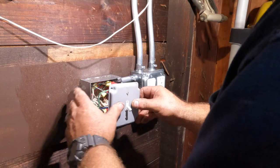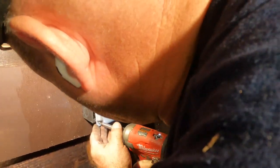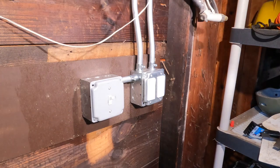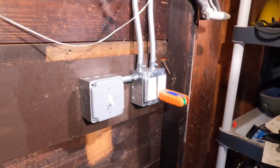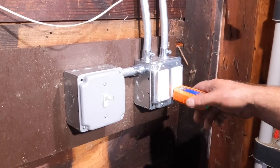Another code requirement: with metal boxes, you want to bond them with the equipment grounding conductor. The length of the conductor must be a minimum of three inches outside the edge of the box. Conductors coming in through connectors must be a minimum of six inches. I usually just put my fist up against the box and cut about an inch past my fist — that's usually enough. And here you can see we've got our proper voltage; I turned off the disconnect switch and that green light blinks, confirming the power is off.